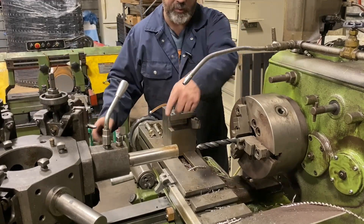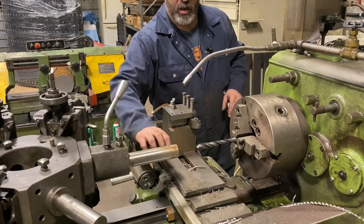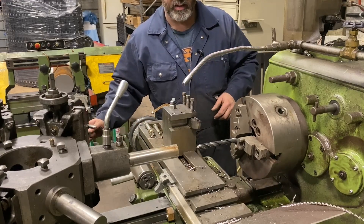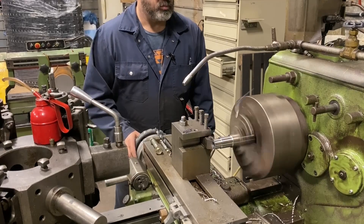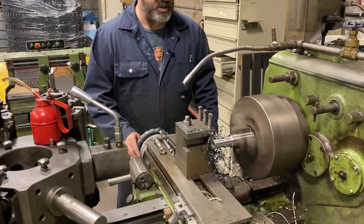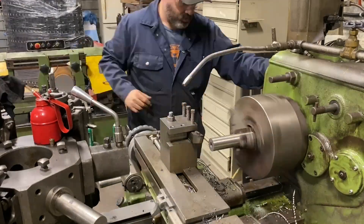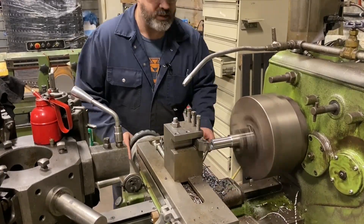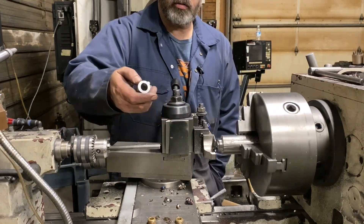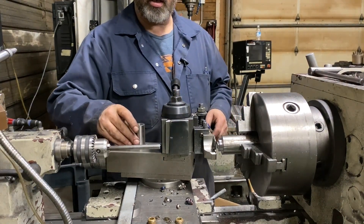So now I'm going to change positions. I'm going to pull that out of the turret, put it in the jaws, and I'm going to turn the outside diameter down on my bushing about 2 inches or so. And then once I'm happy with that, I'm going to transfer it over to the little engine lathe and then we'll part it off to length. Downside of that is you've got the long stringy chips. We're getting close to having our bushing. There — we've got two 1 inch diameter, 2 inches long, 5 eighths bore bushings for our hockey puck mounts.